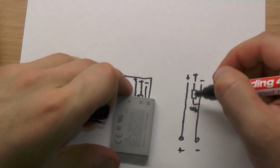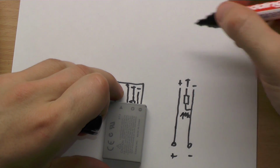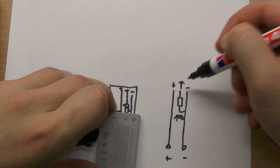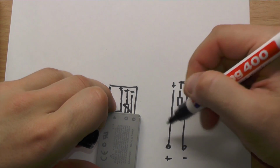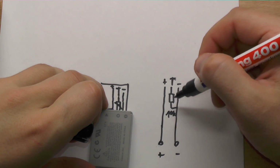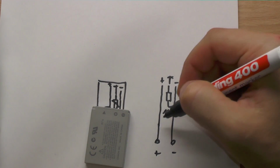So I will put a 10K resistor here, and we have, yeah, our simulation complete. And the circuit of the device will see, okay, this battery isn't overheating, so the resistance is high enough, and it's not overheating, so we can take more power, more power, more power. Okay, so this is how we can emulate this,